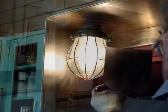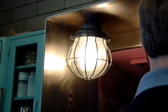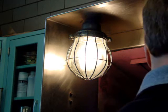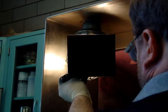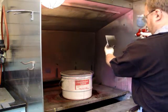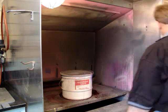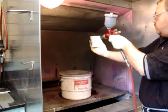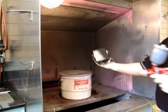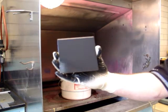You can check this on glass by holding the piece up to a strong light. Apply the marking material evenly until you cannot see light shining through the glass. Use the same techniques when spraying tile. Remember to apply the material in smooth, even strokes. Some practice may be necessary to achieve the best results. An even application is essential to achieving the best looking laser marks.